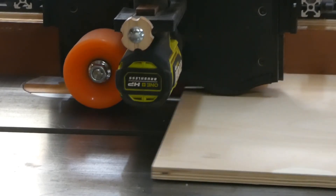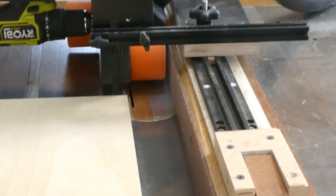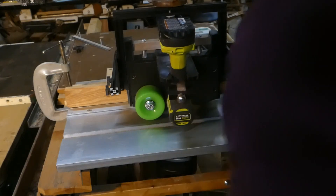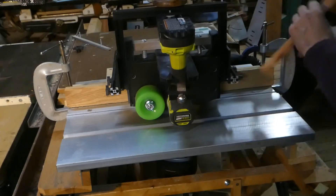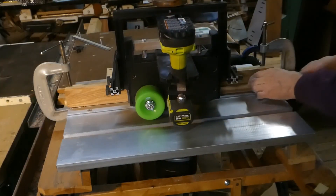The side view shows the orientation of the feed rollers. The third, outboard feed roller pulls the cut piece away from the blade. Here's the feed roller engaging the work with the rollers straddling the blade. On the router table, short pieces can be safely fed without feather boards or additional hold-downs. Long moldings can be cut without pauses in feed that cause burn marks.